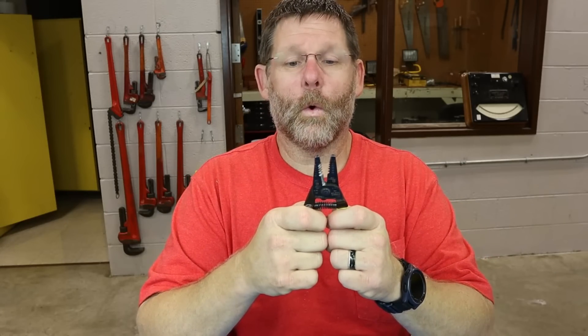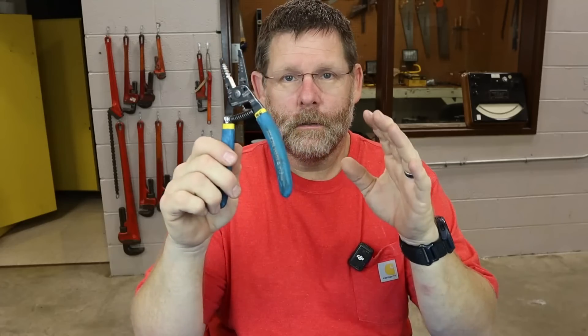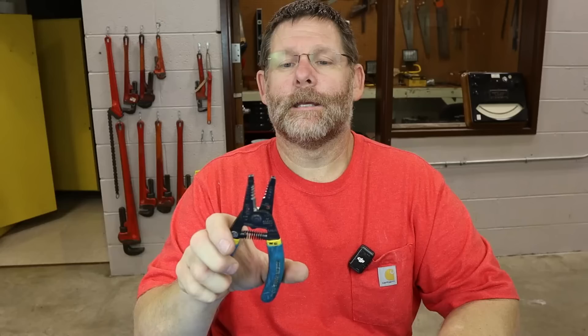Now we're going to learn how to strip wires. I already did a video on how to make hooks on wires. We're going to go over the very basics of the strippers here. This is the pair that I have. Two sides on your strippers — one side is for solid wire, one side is for stranded wire. Keep in mind, if you're in my class, almost all the time we will only be using solid wire. Not saying we will never use stranded wire, but for our demonstrations and trainers, we're always using Romex, which always has solid wire in it.